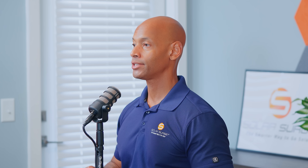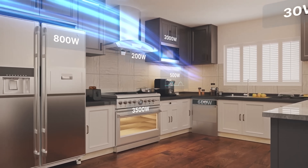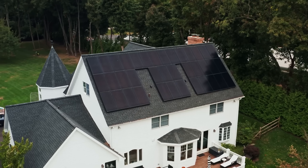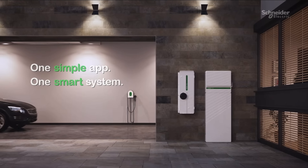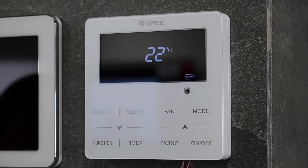When you add battery storage coupled with your solar power system, you get three major advantages. The first is you can now self-consume your solar energy 24 hours a day. When you have excess solar power available during daylight hours, instead of trying to sell it back to the power company where you may or may not get full price credit, you can take all of your excess solar generation and charge it into a battery. Then during the evening hours when the solar panels are no longer producing, you just power the house off the battery — more self-sufficient and self-contained. This also protects you from the loss of a net metering program.